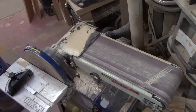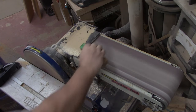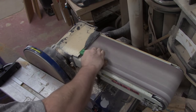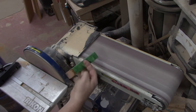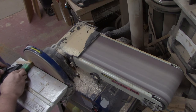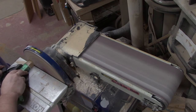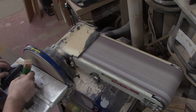Yay. Now I take back over. I always like to shore up the sides, kind of take the little ridges that form off of there, and the ends as well, because sometimes the molds aren't square, sometimes the cuts aren't square. So, first the little ridges that form at the top, and then the ends. And with that, what taking care of the ends does is that it makes sure that between my two points on the lathe, it keeps it straight. Lopsided turning is not recommended.